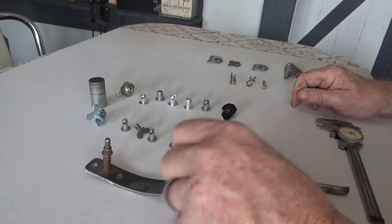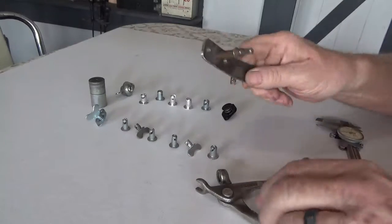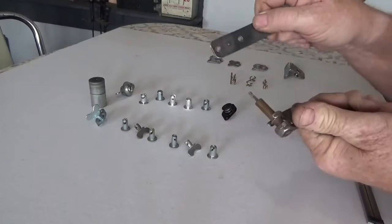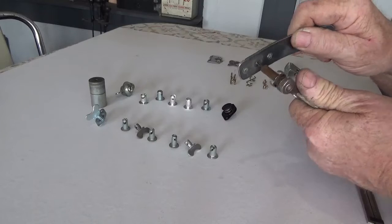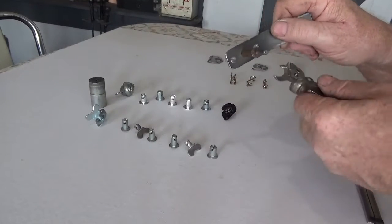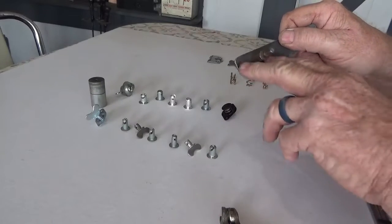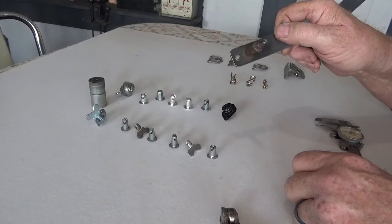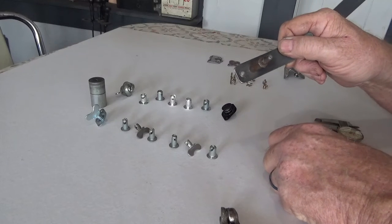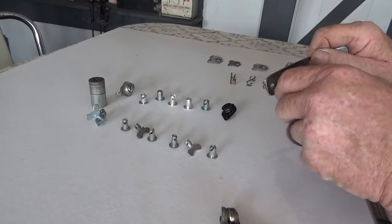What I do to mount a spring — I have a tool like this, and it's got a CLECO in it. I'm hoping you all have heard of CLECOs. I'll drill my holes where I want all my buttons and my springs, and then I will CLECO this down and I can drill these holes. This one here is for a dash-six spring, which measures center to center at inch and three-eighths. A dash-five spring measures one inch, and I'll show you that right now.